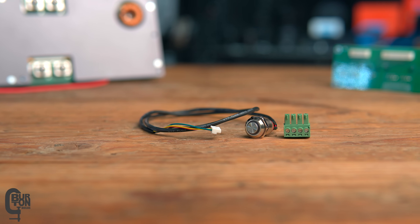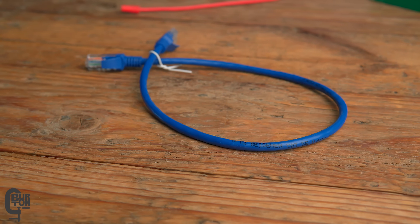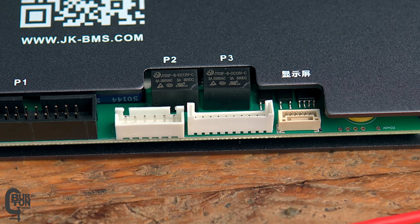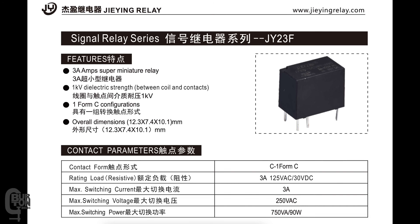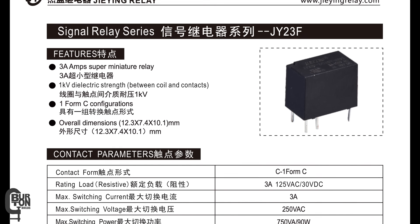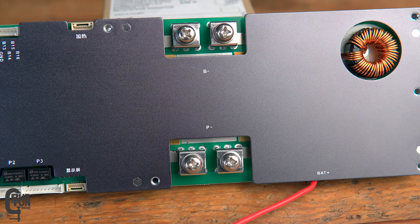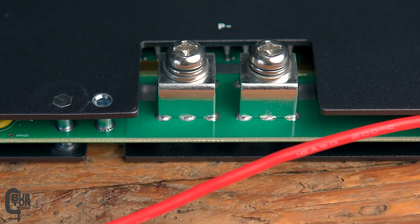The switch wire is 500 millimeters long, again 19.7 inches, and the Ethernet cable is a Cat5e cable at 490 millimeters long. I really like the fact that there are two programmable relays on these inverter BMSs. Each relay has dry contacts which connect to the interface board, and each can handle a switching load of 90 watts, a maximum switching current of 3 amps, or a maximum switching voltage of 250 volts AC. It also has really solid terminal blocks for both the battery and load connection points, using two 6 millimeter machine screws to fasten your lug onto the terminal block.